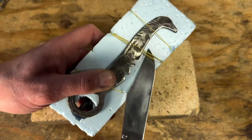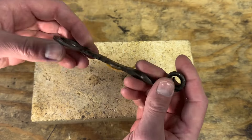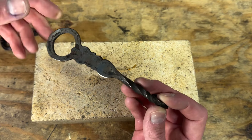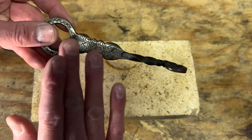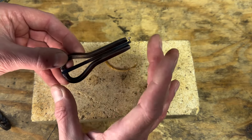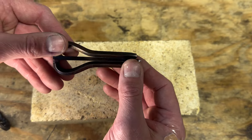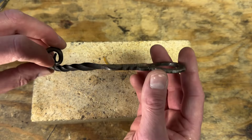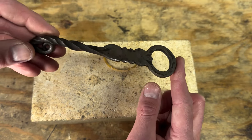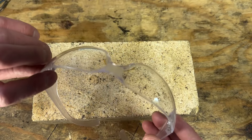These are forged, so there are byproducts of forging and there might be a little bit of rust on here. What we're going to want to do is clean them up to bare metal — get rid of any rust, any corrosion, any oil, any dirt. We want to get that either sanded or wire-wheeled off so we have bare metal, and then we're going to heat it up until we get a healthy level of oxidation. Unlike rust, which is detrimental to metal, this is a healthy, semi-protective layer of oxidation. You can use sandpaper or a wire brush, but I'm going to take it to my bench grinder with a wire wheel.